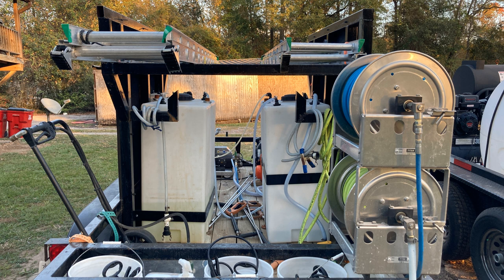Looking from the back, we've got our two 85-gallon tanks. The one on the left is for the bleach and the one on the right is for the water. The bleach feeds the Kingslinger 10-gallon-per-minute soft wash system. We also downstream out of it — we just add our soap to the tank instead of metering soap, so we're actually downstreaming out of the bleach tank. These 85-gallon tanks are perfect size; they're vertical and a little beefier than the 55-gallon ones that tend to crack. These are thicker-walled and I'm just absolutely loving them.